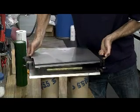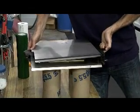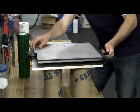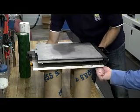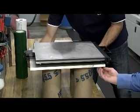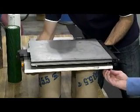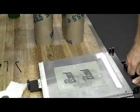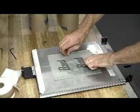As all presses are different, some require that you transfer the counter outside of the machine, like this one. It's ideal to have two operators access all screws at the same time, so the counter is dropped down evenly and adheres to the Makeready float sheet in an even manner. Now we'll remove the counter pins.